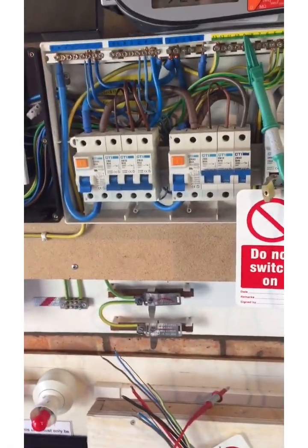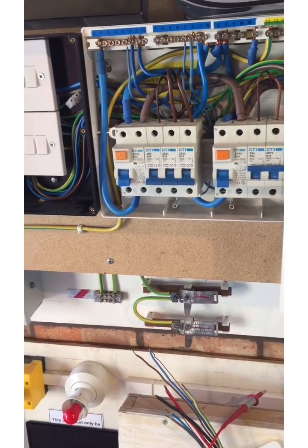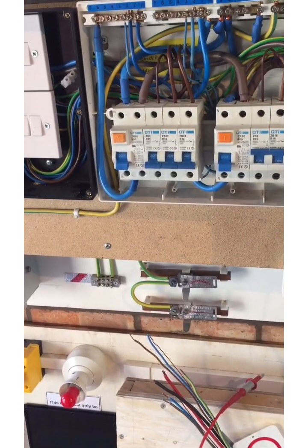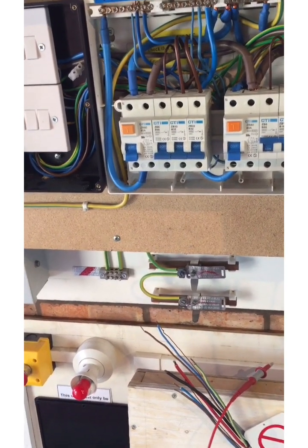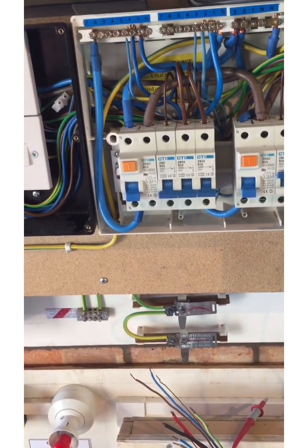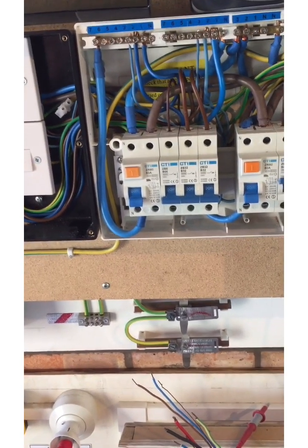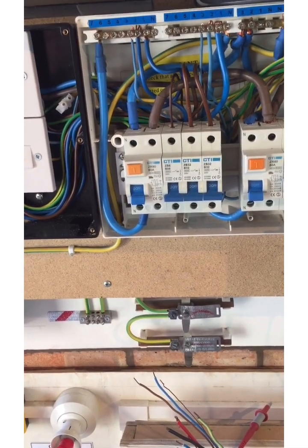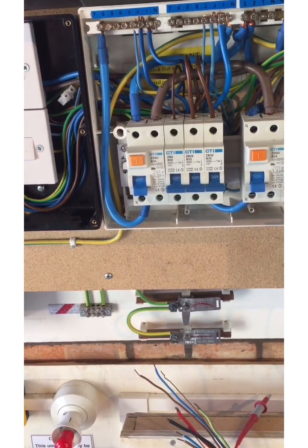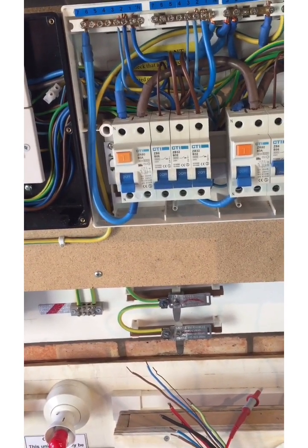Let's talk about what kind of possible scenario this might be. Let's say it's a domestic rewire and on day one we managed to, along with other things, get the downstairs lights wired and connected up. What you would do in that situation is you would do a little mini test on the lighting circuit before you connect it up. At a minimum, you're going to do continuity protection conductors, R1, R2, which gives you polarity and also insulation resistance. When you do a test like that, don't be tempted to test the cable without having the CPC connected at the board, because it's only then that other faults can reveal themselves that wouldn't if you tested the cable with the three conductors — if it's a single phase circuit — disconnected from the board.